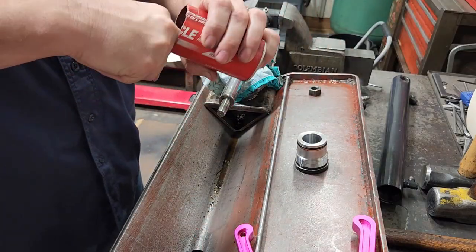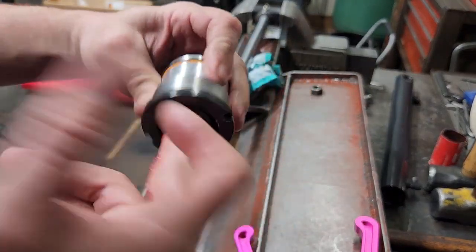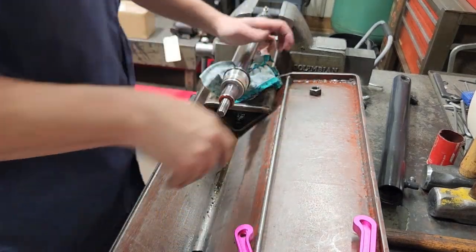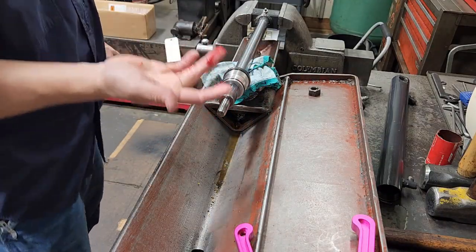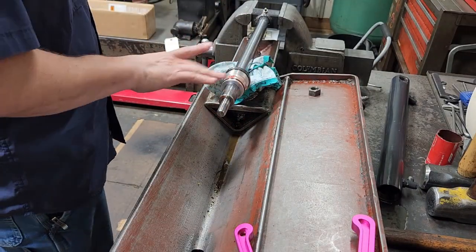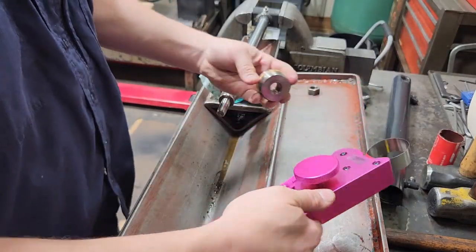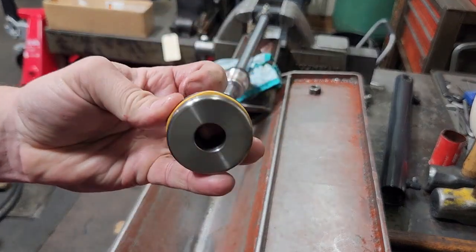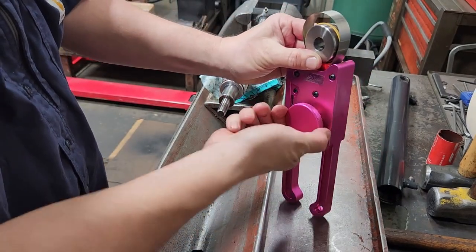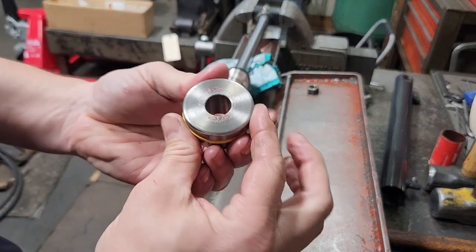In the meantime, take some grease and grease the inside of the seals, then put it on the rod. Wipe the excess grease away and check for any cuts or pieces of rubber. Use excess grease on the o-rings. Remove the piston — as you can see it's still deformed on one side — rotate it, put that lump towards the top, put it back in there, snug it back down again. Now remove it and the seal is good to go.